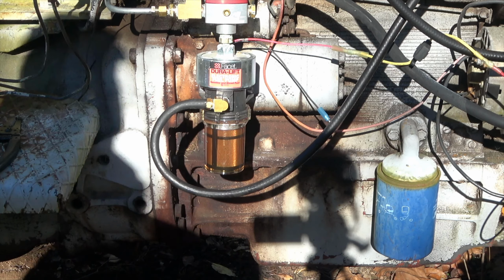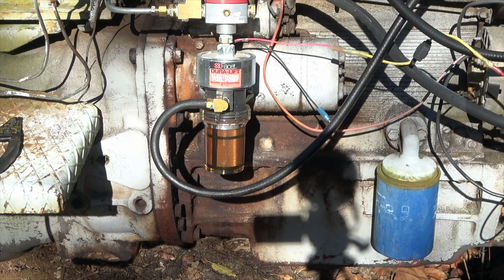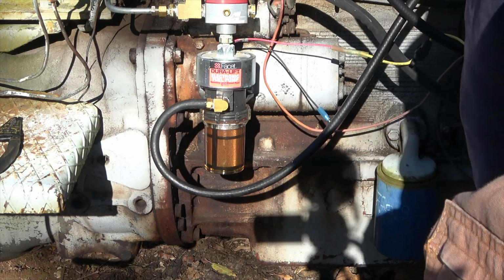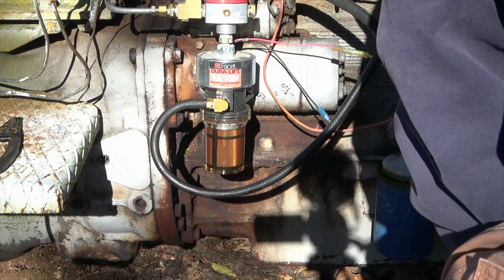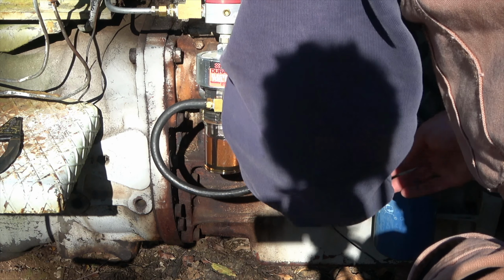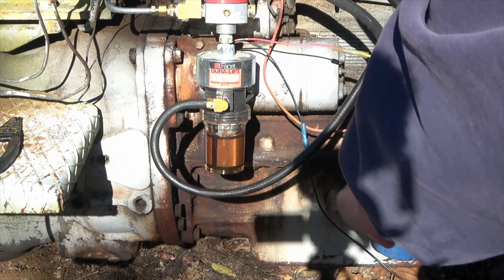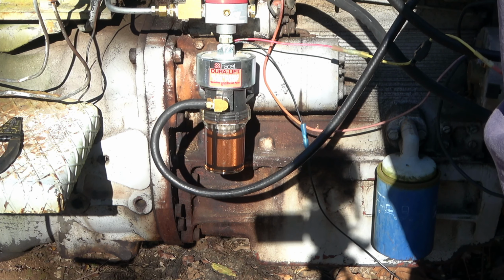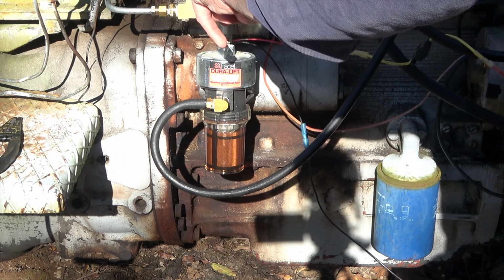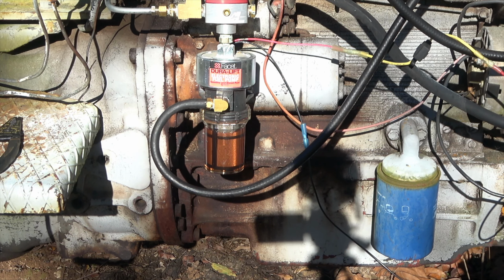Okay, here we go one more time with the startup. I went and got a new battery, and now I'm going to start the pump for the second time. First time it did displace a reasonable volume. Okay, here we go. Goes up there, pumping up, displacing fluid. Pump is slowly creeping up to about 4 psi. I didn't have to adjust it. If you adjust it, it's from here. I loosen the nut and adjust it, but right now it's 3.5 or whatever it is. So I'm happy with that.